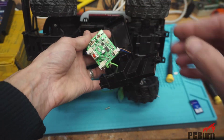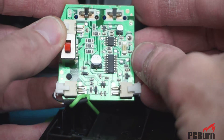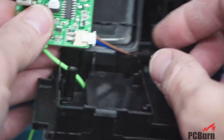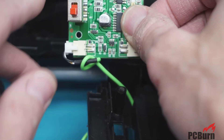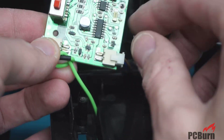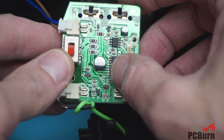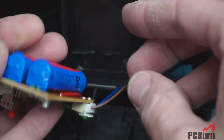Let me zoom that in. These electronics are pretty clean. I'll have to take a look at exactly what's on the board. As I suspected, there's a DC motor in the back and a servo motor in the front. We'll take those out in a second, along with a couple of batteries and some control circuitry. I would conjecture they use this board for different things, where these functions aren't currently being used — so they're just jumpered with a zero-resistance jumper. There are a lot of those on there. And there's our antenna for the 2.4 gigahertz right here.